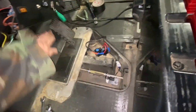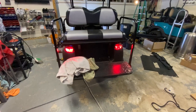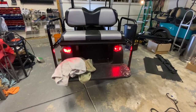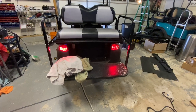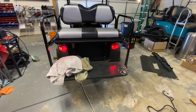Tail lights working properly. Now let's do a brake light - and before I put everything back together - yep, they are brighter. Give it a second and the timer should kick in and these should go down to just regular tail lights. It's a little black timer box that goes through its own little cycle - there they go, they just went down.